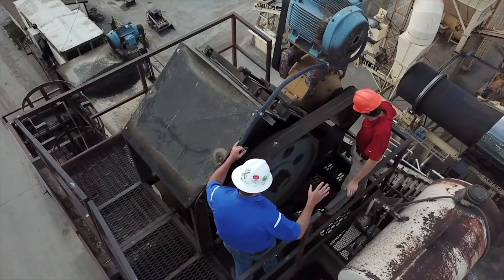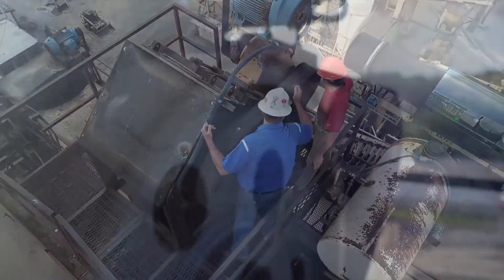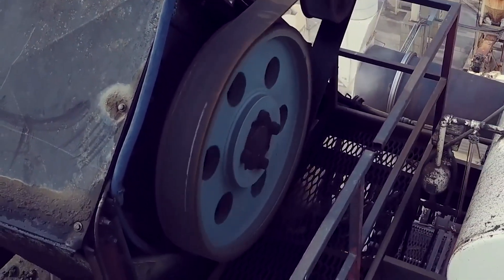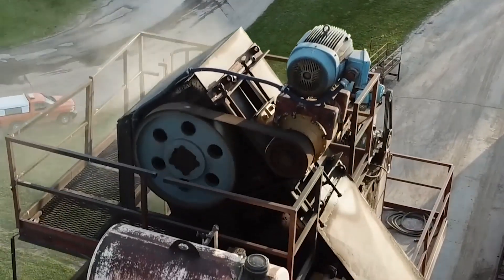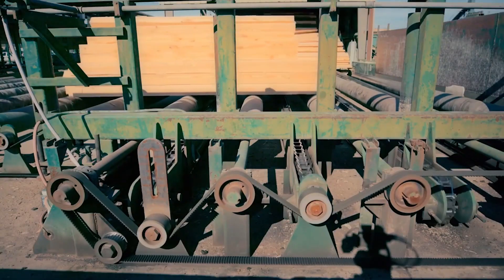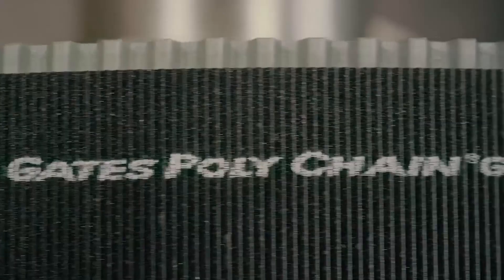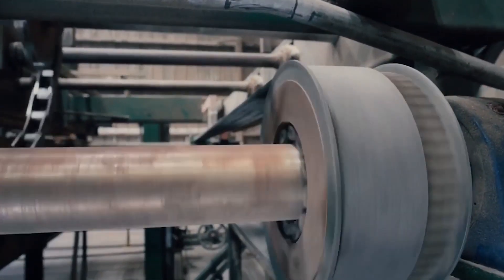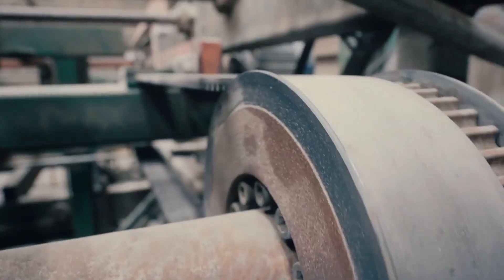Polychain is engineered with robust carbon tensile cords, which minimize stretch and provide extraordinary strength and loading capacity equal to that of roller chain. The Polychain is fully operational in temperature ranges from negative 65 degrees Fahrenheit to 185 degrees Fahrenheit. This unique construction makes Polychain belts extremely tough and virtually immune to abrasion and chemical attack. Since Polychain belts do not require retensioning or lubrication, they make an excellent alternative to roller chains — offering a much cleaner and more compact drive solution at the same or higher power capacity.